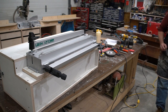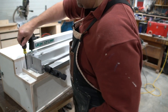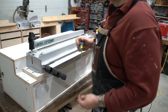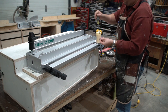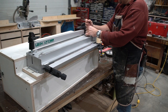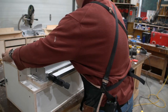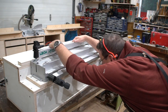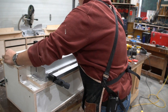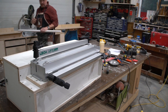These are actually black Robertson Number 3, but the Number 2 Robertson that comes with the jig works really well. I don't fully tighten them until I get all four threaded in, and then I go back and tighten them all — because if it's slightly off... these actually worked out really well. As long as you get one of them started you should be good. Now that this is down, it's dead on. That's perfect — dead flat. I'll make this a little smaller so it doesn't go the full width because it doesn't have to.